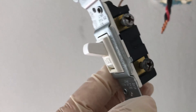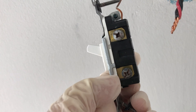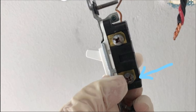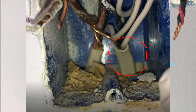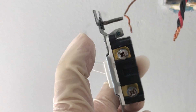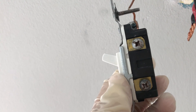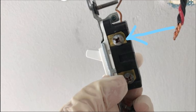I'm going to connect the two hot wires — color-coded black and red — bringing power into this light switch box, and the wires continuing the power to some other part of the house, to the bottom of the switch. A lot of light switch boxes will not have this second set of wires going to some other part of the house and may have just a single hot black wire coming in, so you would have just one black wire to connect to the bottom. I'm going to connect the hot wires that will be powering the ceiling fan and the lights to the top of the switch. Normally, electricians will use the red wire to connect to the ceiling fan lights and the black wire to connect to the fan.